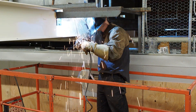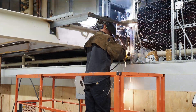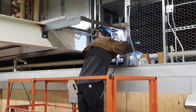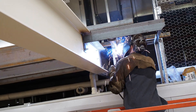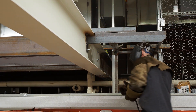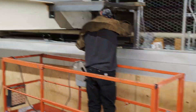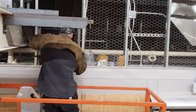Even the grates get their rods stuck. You rip out another one and you move on. You saw how I removed my lead from it once it wouldn't come off — just take the lead off, wiggle it, and snap it off. I wasn't supposed to fumble it though. Here I am tacking up the crossbar. Always tack in the corners — your welds begin and end in the corners. If you put your tacks right in the middle of where your bead is going to weld, there's going to be an ugly bump or a lump, or it's not going to fuse right at the toes down into your piece. No matter what stage you are in your welding, tack at the corners where you're going to begin and end your weld beads.